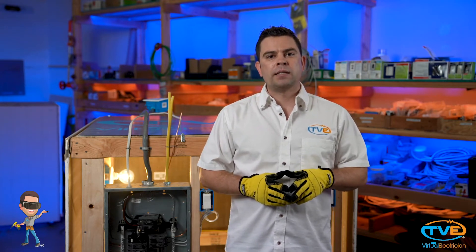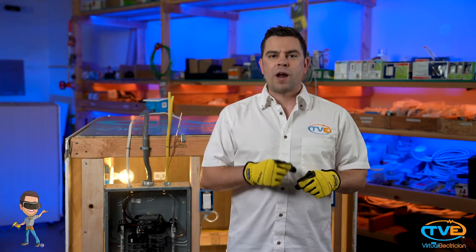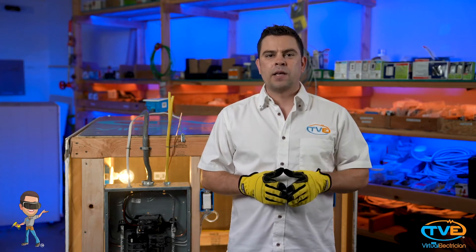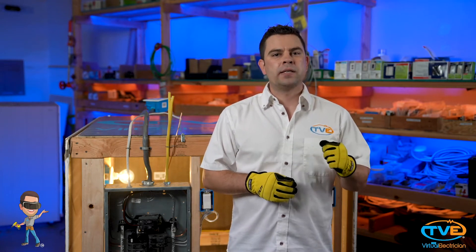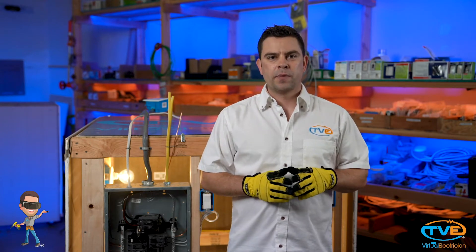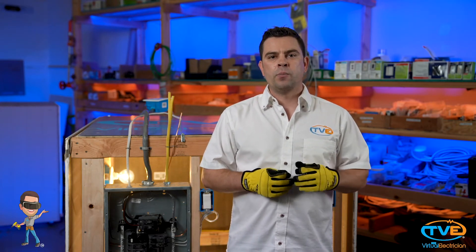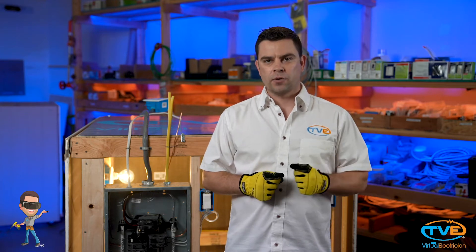Now, if you have a bunch of wires in the box, someone may identify the hot wire by wrapping the wire around the other wire — that's a common identifier. If they didn't do that, you can always follow the wires to see if they are a pigtail for the live wires, then you know whether that is the hot or switched wire. But really, for single-pole switches, you don't need to know because you can hook them up to either screw.